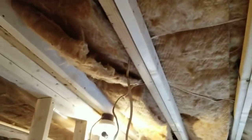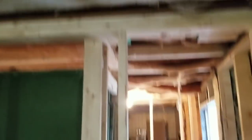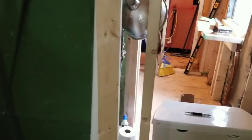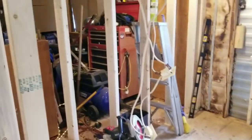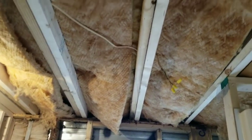Okay, another update. You can see the ceiling's done. Got the two by fours put up and coming back here to the back bedroom — got the bedroom wall almost done. As you can see, got the double plate on the top and I did a double on the bottom. But I ran out of two by fours, so I need one or two more two by fours and this wall will be done. Then I need to go ahead and run the electrical wires back through the wall, put in the new switches and new boxes in the bedroom and in here, and reinstall new plastic. I would have already done that if I could have found my staple gun — I don't know what happened to it.